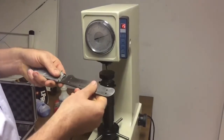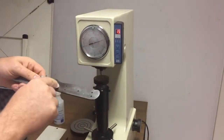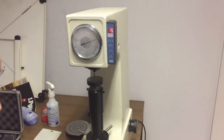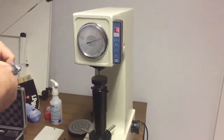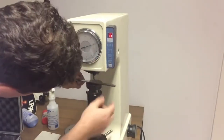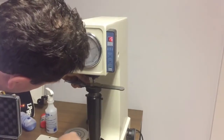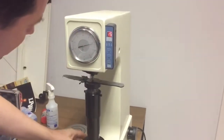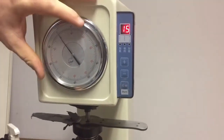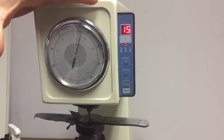Take one of these — it's a customer's blade they've sent for hardness testing. Hardness testing is going to leave a mark on the blade so we always test back behind where the scales will be, but as close as we can to the front. Just need to remove a little bit of tape. Any imperfection — any spot of dust or rust or anything on this anvil or on the blade — is going to cause a false reading, so we want to make sure all that material is out of the way. We're going to preload it; I'm going in between the two pin holes. We know there's going to be scale there to cover the mark. Some people like to leave the indent on the face of the blade so they can tell their customer exactly what that mark means — that they have actually hardness tested their product.